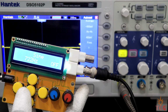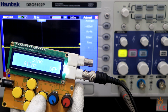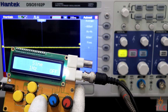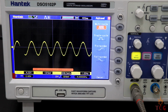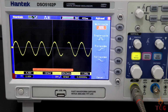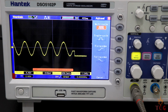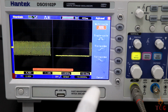Now I have connected the oscilloscope back to DDS generator output. Specification says that the lowest frequency it can output is 1 Hz. I want to see that on the oscilloscope. The frequency is now set to 1 Hz. Let's turn the output on. The frequency on the oscilloscope is around 950 mHz on the yellow strip near the mean voltage. But at the bottom, it's not able to display accurately. I'll try 10 Hz now. Okay, now it is displaying the frequency correctly at the bottom also.